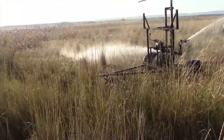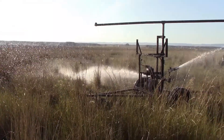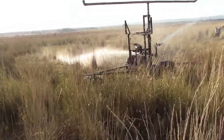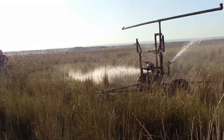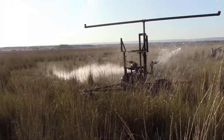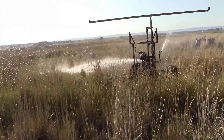I'll also note I built it out of ridiculously thin metal — again, something I wanted to do to see where this frame would break or bend. I can see I'm getting a little U right there. I'm not sure if that's related to how hard this is pulling the hose or what's going on. I think it's related to the hose because that's which way it would divert. But that's why I did it thin — I really wanted to see where the stress was on this, because I can actually add gussets down to drive that force back into the frame.